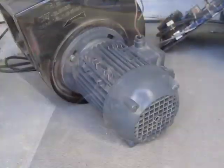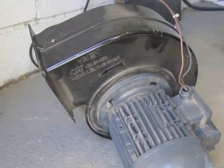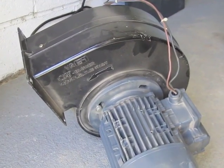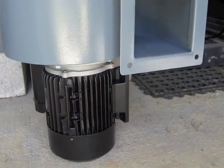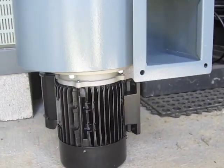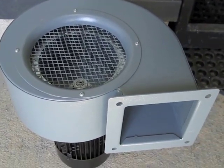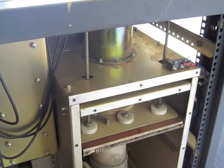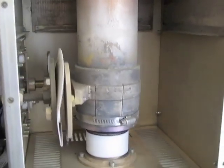Here's what I'm in the middle of fixing. I have to take the blower out. There's the old blower — the bearings went bad on it — and I've got a new blower to put in. This time I'm replacing the motor and the squirrel cage both together. In the past I had replaced just the motor itself, and I think the squirrel cage on the old one was out of balance, so it was kind of a problem. Here's the business end of this three and a half kilowatt FM amplifier transmitter.